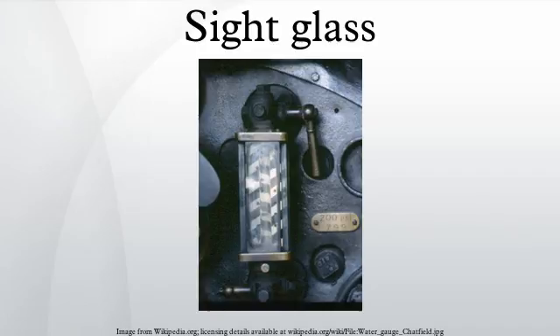Pull the glass down to the bottom so that the gap in the upper and lower valve bodies is even, hand tighten both nuts, and then using a wrench, give each nut an additional quarter turn. Crack open the steam side valve and allow the steam to lightly blow through to warm the glass — this prevents the glass from being subject to sudden thermal shock. Close the drain valve and crack open the valve on the water side of the glass, observe the gland for leakage and tighten as required, then open both valves fully.